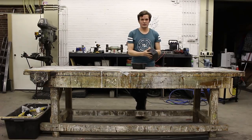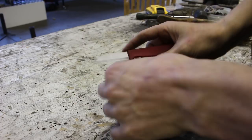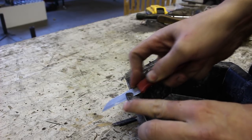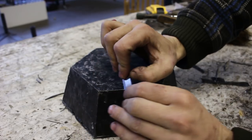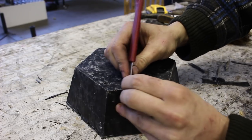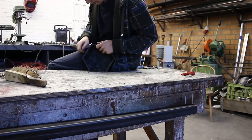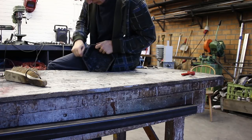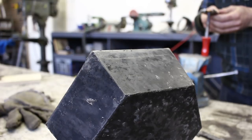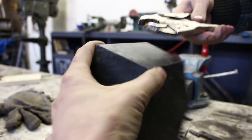For finishing the bowl, use a sharp knife. Polypropylene is not easy to sand because it's too soft, so use a sharp knife to first remove the excess material, then scratch all the edges to make them really smooth and nice. Finally, add the polypropylene logo so you still know this bowl is made of polypropylene, making it recyclable in the future.